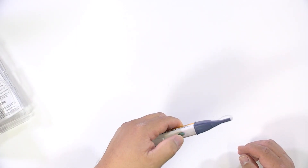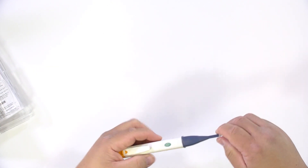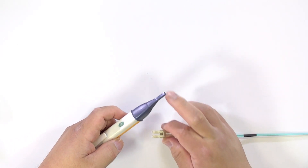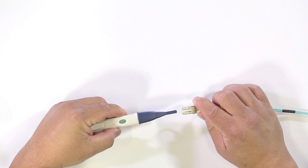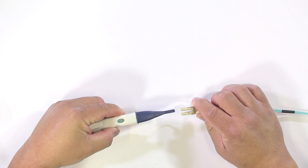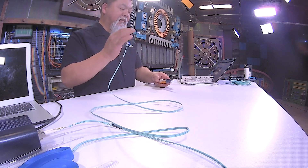I'm just going to press the button for less than a second, and when we do that you actually end up seeing the light begin to flash. I'm going to remove the tip and then we'll be able to test with my fiber optic cable. If the cable is good I shouldn't have to touch the cable tip at all — and you can see I had to hold it in a range there, but it did beep. So I know which of these two tips has the fiber light going on, which verifies it's good.